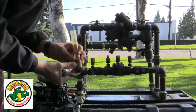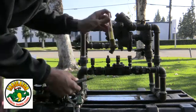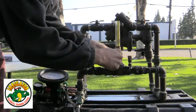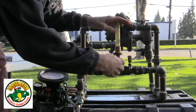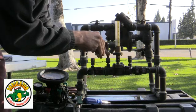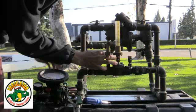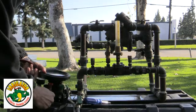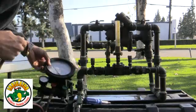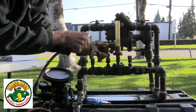I need to install my sight tube on test cock number three — this is behind the first check valve. Fill it up and close that. Then I stick my bleed off valve arrangement on number two; this is in place to compensate for a leaky number one shutoff valve. I've got my differential gauge — hook up my high side hose to test cock number two with the bleed off valve arrangement on that.